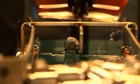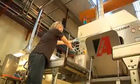After pressing, the pole faces of the armature tops are machined to have a smooth, even surface. Next, the completed armature tops are washed to remove all dirt and oil particles.